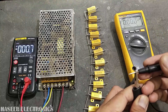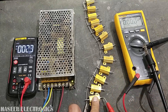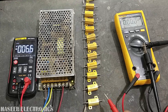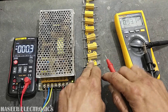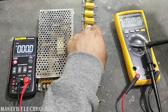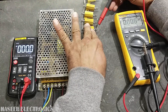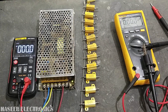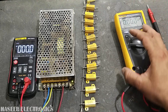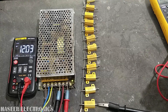Let's start. I am connecting the multimeter to measure DC ampere. The first resistor is reading 1.7 ampere. Each resistor will draw 1.7 ampere, so we will increase them one by one. If you use this multimeter in series it will only handle up to 10 ampere, so I will reconnect the multimeter. The first resistor is drawing 1.7 ampere.